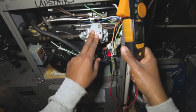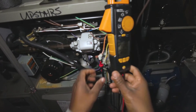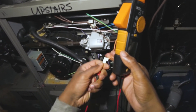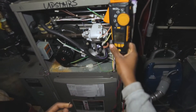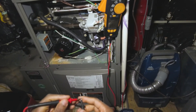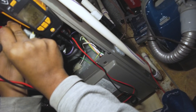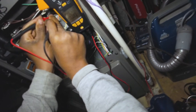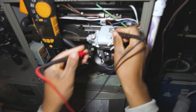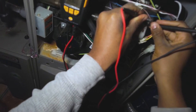So we're definitely getting voltage. More than likely the windings in this gas valve have been shorted — it's just not pulling the solenoid. What I'll do is check these windings and ohm it out. It's reading 0.99 kilohms on one winding, and 14 kilohms on the other.